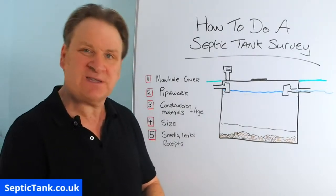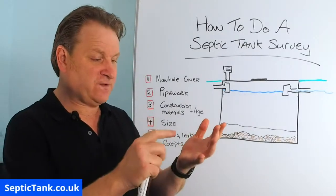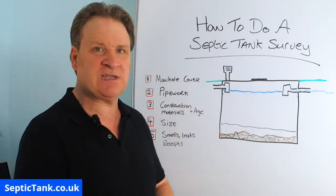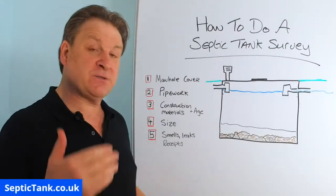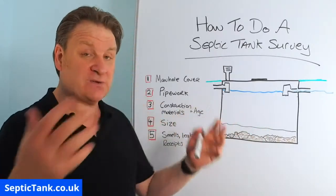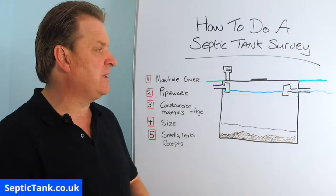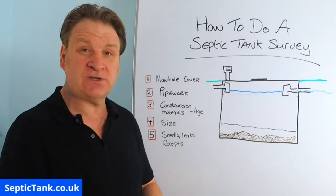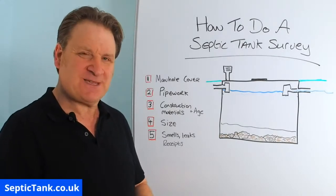They'd see how much you've had taken out of the tank. If it says on there you've had 1,500 litres taken out, well, that's a good indication that your tank's half the size of what it should be. So they can then put an enforcement order and get you to replace or put a new septic tank in. So if you need to find out the capacity of your septic tank, just go and consult your septic tank emptying receipts, right?